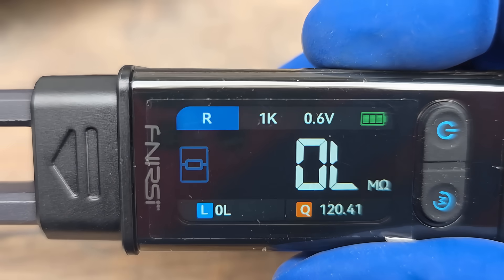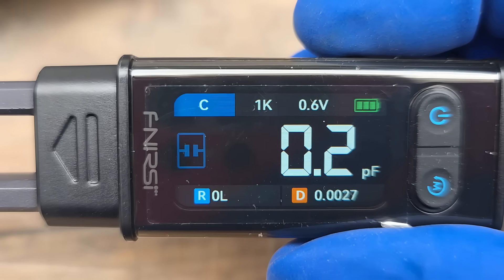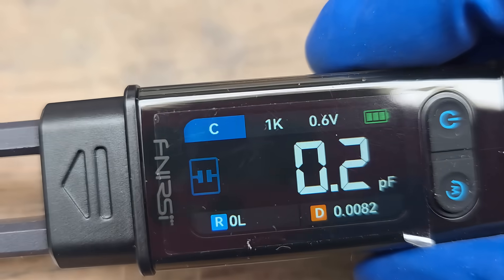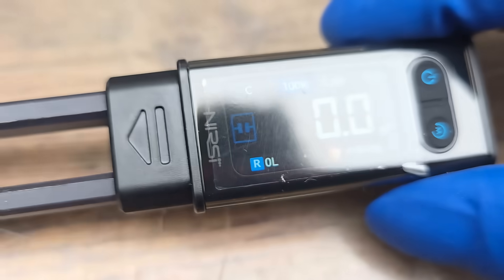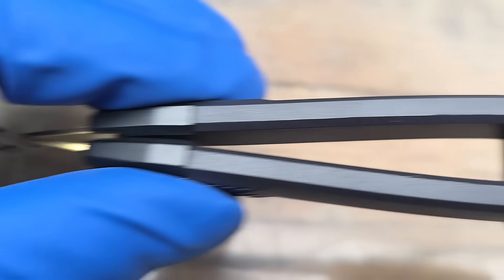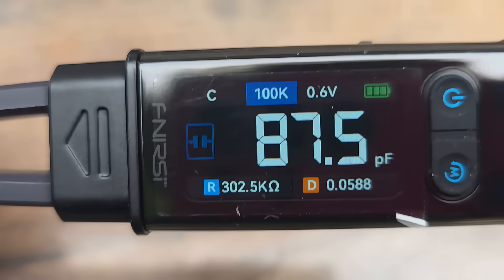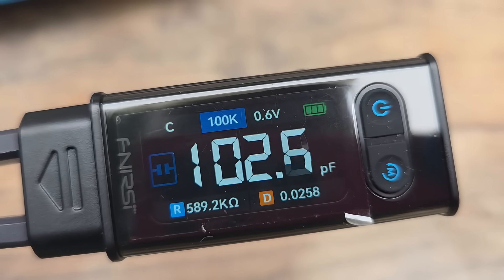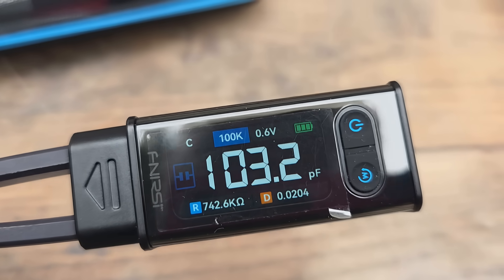So that's resistance - we're at 1 kHz and 0.6 volts. There we're at capacitance. Down here where it says resistance, that's the ESR. Since this is a very small capacitor, I'm going to set this at 100 kHz, pick it up in the tweezers and see the value. It looks like that side is measuring 87 pF, and the other side, which is physically bigger, is measuring 103 pF. I believe this is pretty accurate - I would use this to select a capacitor.